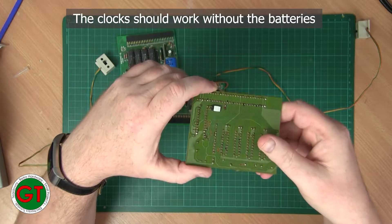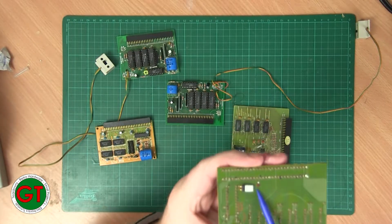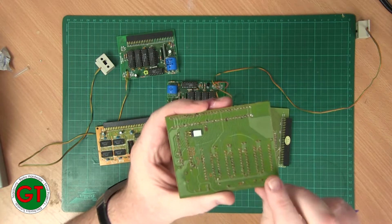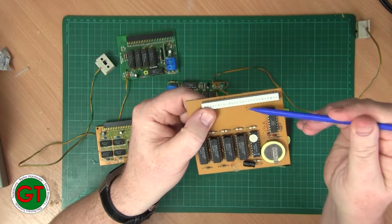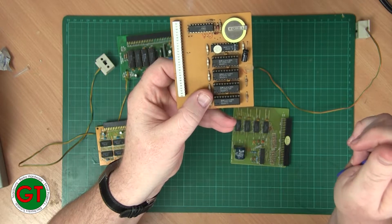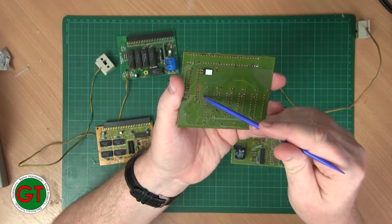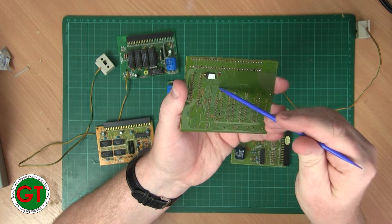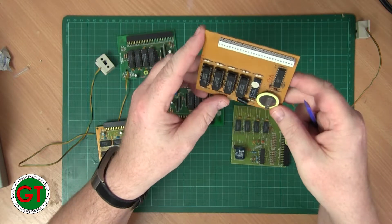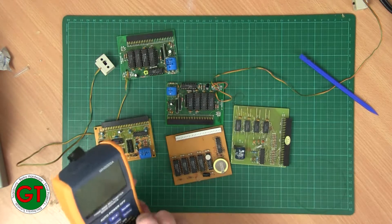This one didn't work, but afterwards when checking I noticed there is a pad that's been lifted off, and on this side you can see there used to be some wires connected. There was obviously a switch there that had been hot glued so that somebody could just reach in and flick it on and off. I think if I follow this trace down and solder a wire onto here and back up to this pin, then this one will probably work. Not sure if there's going to be any charge left in that battery.